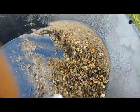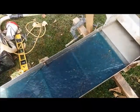I like the U-mat design — it'll get rid of all the bigger rocks and just leave me the real fine stuff. Gold is sticking in it. We got done with that and I like what I see. Look at all that gold in the top riffles — there's one big one that didn't go down at all.